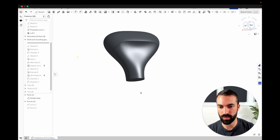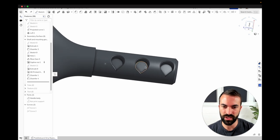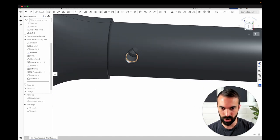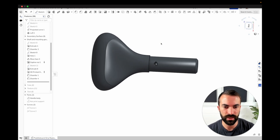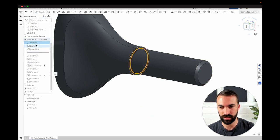Now that I've got that capped, the next thing is to build the shaft and all the stuff needed to actually attach it to the existing handle. It's a shaft that comes out and has three holes that make room for the pin so that when you adjust the thing all the way down there's still room for the pin to go in and lock it. Then this smaller hole receives a screw that acts as a linchpin to hold the entire handle into the metal tube that attaches to the paddle. This is pretty basic stuff — circle sketch, extrude, and then a chamfer to make it easier to lead in.